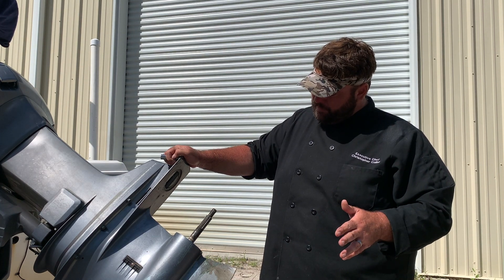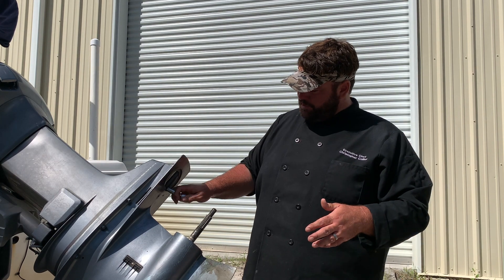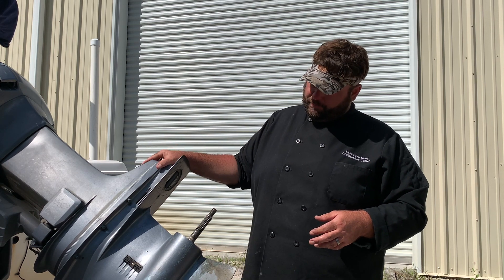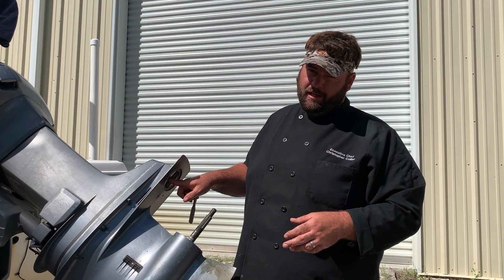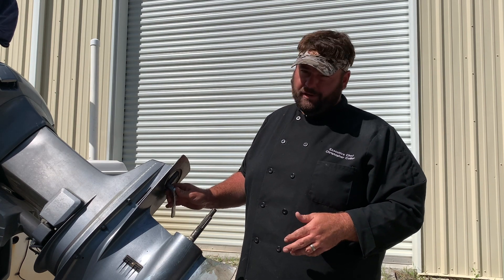To remove this, there's usually a zinc up here — about a 12 or 13 millimeter on top to remove the zinc, like a half inch standard. Underneath there's a 14 millimeter or 9/16 bolt. There's one here and three 9/16 or 14 millimeter bolts on the side, three more on the other side, and one up in the top. Drop all those bolts and the whole lower unit will slide right down.